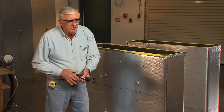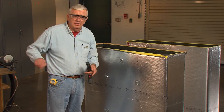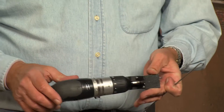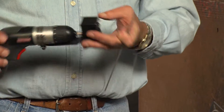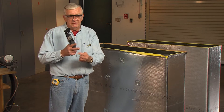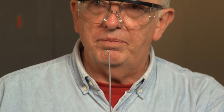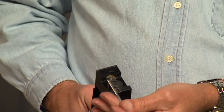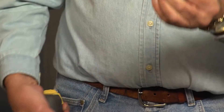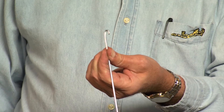The wire is just standard 12 gauge hanger wire like used in the acoustical business. We're going to use the fast loop tool manufactured by Amcraft and put this loop on there. You notice that that is a full 180 degree bend loop. I put the wire into the tool, press the button, and I end up with the proper loop.